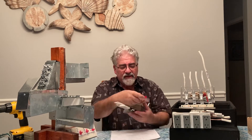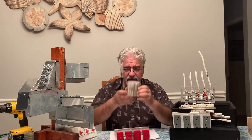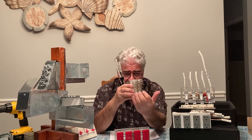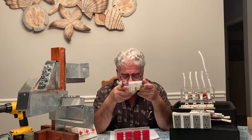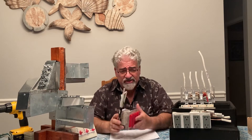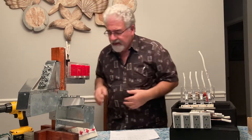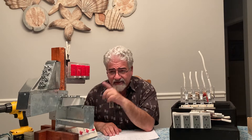As an example, you have the front piece — this is a four-piece receptacle, and this is the hub. The electrician on the first day going to the work site will hook up all the wires to this hub. You can see the wire connections in the front, and more importantly you can see each individual wire through the top. That's significant because the electrician doesn't have to get on his hands and knees — he wires it up, slides it down, and it's installed and electrically connected. That's the knee saver electrical box — you can do it while standing up.